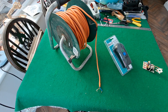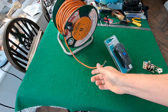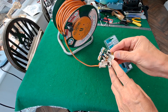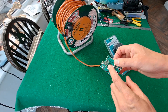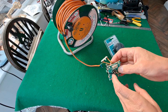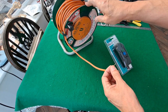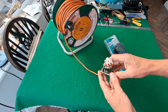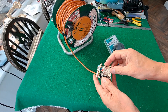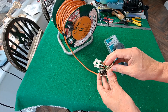A few weeks back I did a video where I took apart the RCD plug on the end of this cable. I looked inside and the coil had actually burnt out quite effectively, and quite a few of the tracks had burnt on the bottom. Not quite sure why — it didn't appear to be the equipment I had plugged into it. I checked the wires for continuity and there's no evidence of them being shorted out. The only thing I came across was that it looked like water had got into the plug itself, maybe condensation over the years. This is probably 15-20 years old and always stays in the garage, so that might have been the problem.